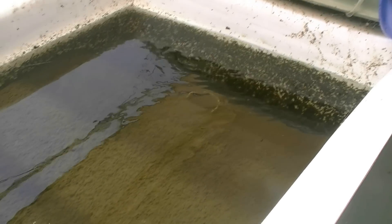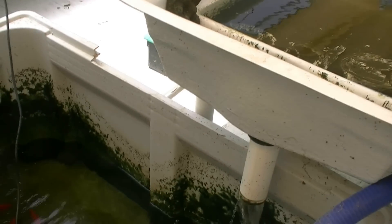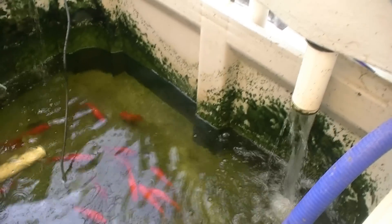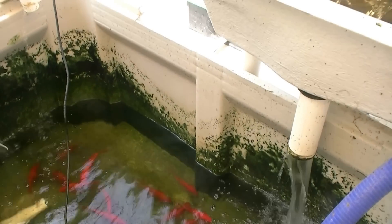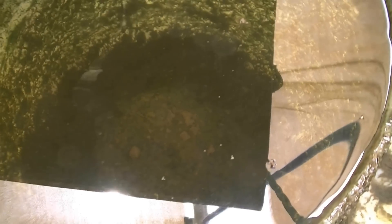This one's a sediment tray - as you can see the water is flowing up or upwelling into that deeper region, it then flows across the tray itself, across the sediment weir, and across this weir is where it flows back into the tank. We can use these trays to take out the waste material that is positively buoyant - it doesn't sink straight to the bottom. In this case it takes out the floating bits of material like feces and little bits of uneaten feed, or even the sloughed-off bacteria layer from inside the tank wall. I've turned it off so you can see right down to the bottom - you can see the amount of waste down there, and that's only after two days of feeding fish at 40 kilos per cubic metre.